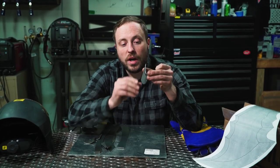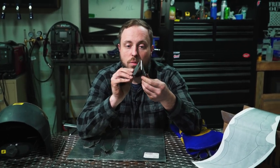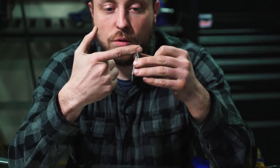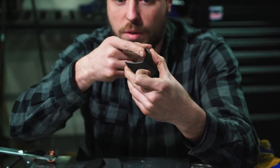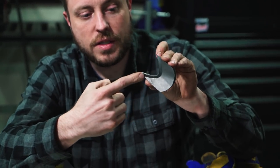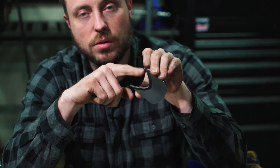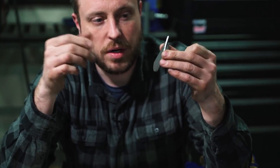You might not have noticed, but when I cut these out, one piece is smaller than the other — and it's so that when they go together, there's an overlap. I don't want to weld on the actual blade edge. Like, this is going to be the knife edge of the sword — I don't want to weld that. If they came together evenly I would have to. Since they're offset like this, I'm going to weld in the offset area. This front piece of metal will be the sword blade right here, and this is mild steel — it doesn't matter if it gets hot.